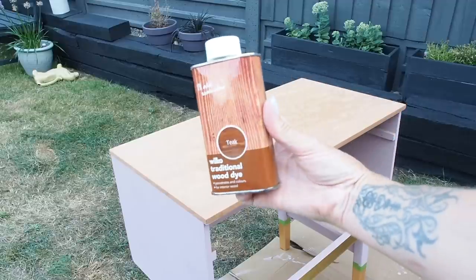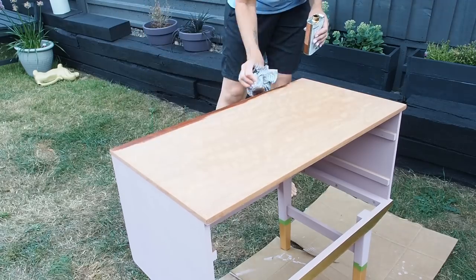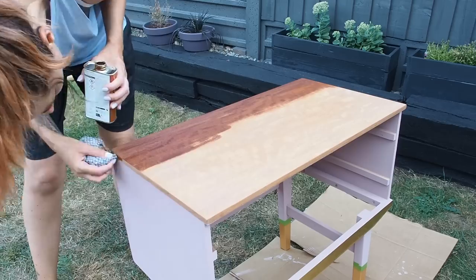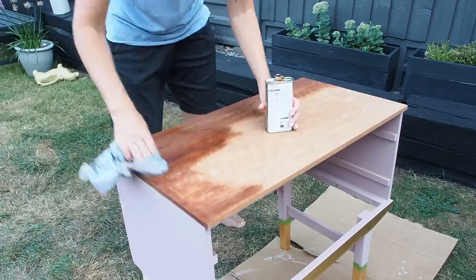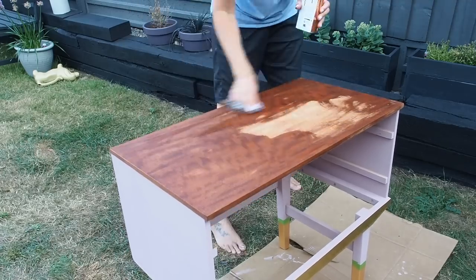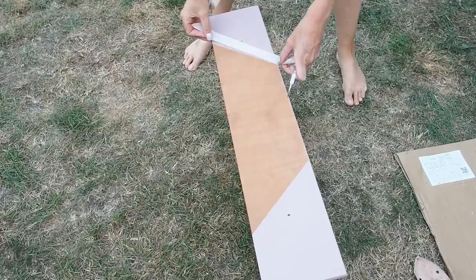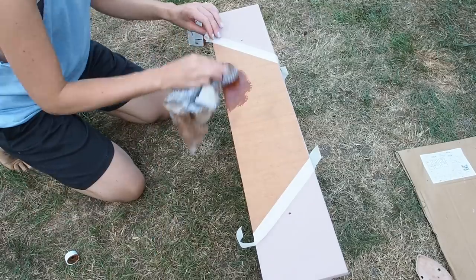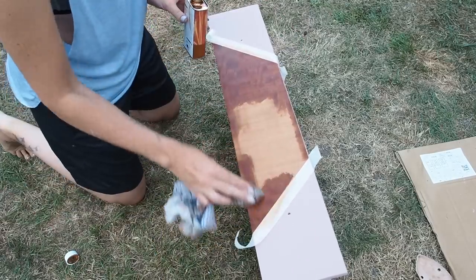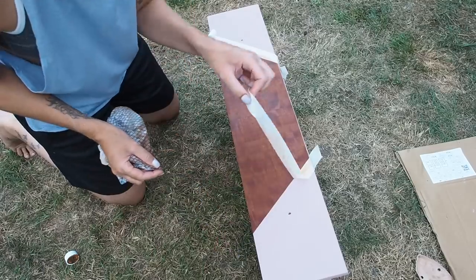Now this might seem like madness that I've stripped off all of the orange colour and I'm now going to dye it again. What I'm going to do is use a wood dye to dye it back to teak — but this will be a nicer rich brown teak, not so orange-y. I'm not going to be varnishing the unit; I'm going to be waxing it and it'll have a lovelier softer finish. You just apply the wood dye with a cloth, rub it in along the grain, and it brings out all the colour and grain of the wood. I'm going to do the same to the unpainted section of the drawers, but to protect the painted section I'm reversing the masking effect and putting masking tape along the paint line.